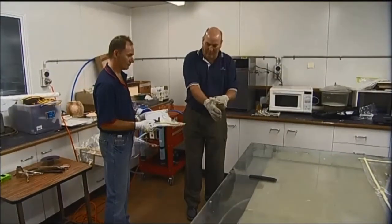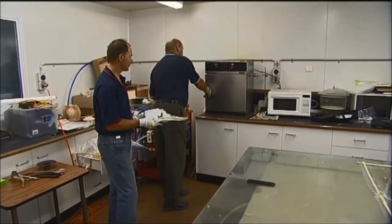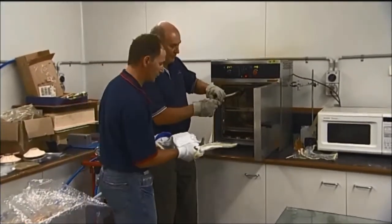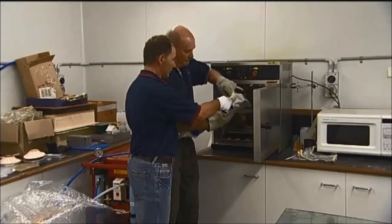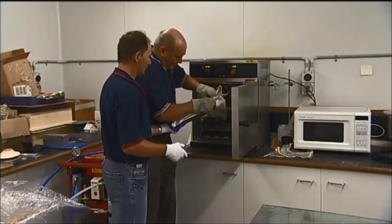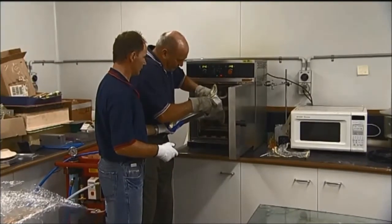Consolidation can also be done during the curing step using elevated temperatures. Heat causes the resin to become thinner and allows the trapped air to flow out easily. The thinning of the resin binds the several layers together, resulting in a single structure.